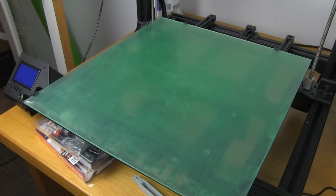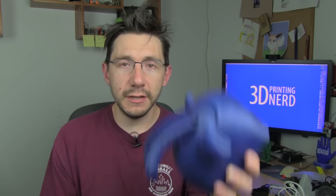You may have noticed some green stuff on the build plate. I ran into an issue with my heated build plate from GCreate — I had some dimples in the build tack and I think there was a problem there. So I sent that back. I had a spare piece of glass and I had this substance called 3D Ease, and I was testing it originally on the Wombot on a heated build plate, and it just failed miserably. But I gave 3D Ease another shot on a cold glass bed, and surprisingly the PLA sticks wonderfully. I used it when I was printing the Sleeper Simulant and when I printed this big ghost, and it worked. So now I'm conflicted — do I continue to review it, or do I just tell you that it works on a cold bed but fails miserably on a heated bed?